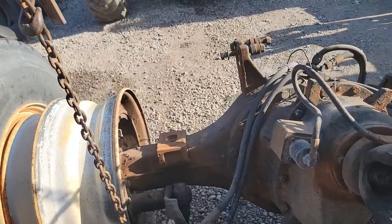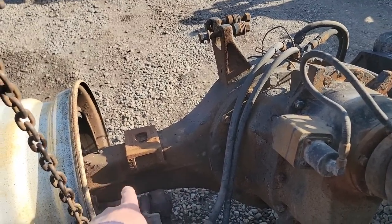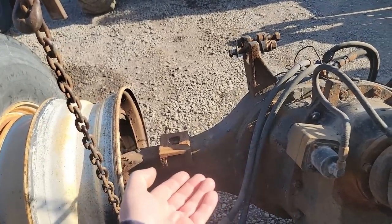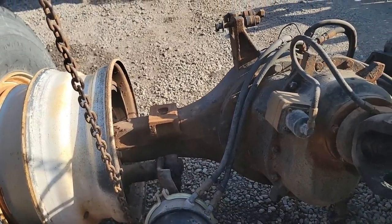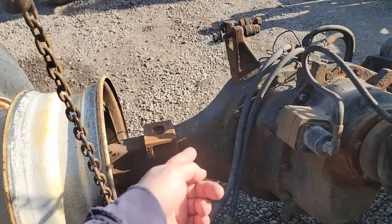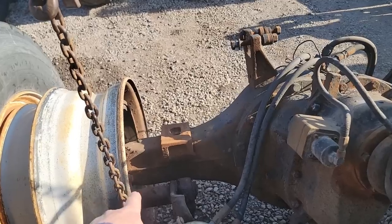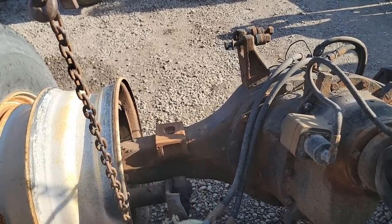So within minutes he called me up, and we talked about why did this weld crack fail, because without knowing why it failed, how would you know how to go about repairing it so it doesn't happen again? Then we talked about how he would clean it up to get the oil out of the metal, and then what procedure he would use, and whether that procedure needed one single pass or multiple passes.